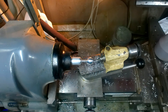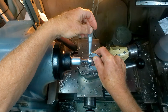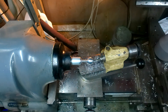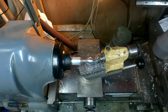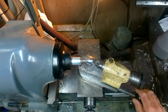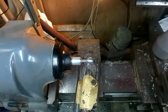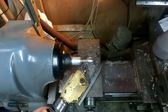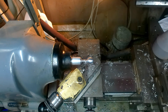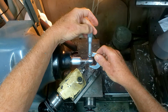I'll put the mic on it again and see how far we've got this time. We are now down to 959, so another 9 thou to go. This is only just a demonstration but I'm showing you how easy it is to get your finished diameter.